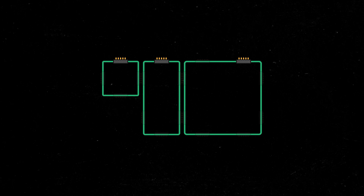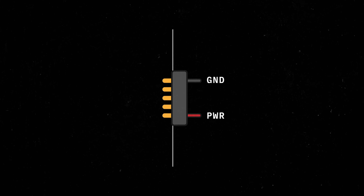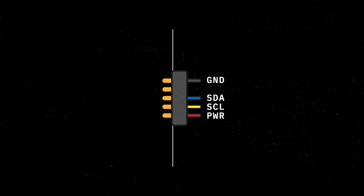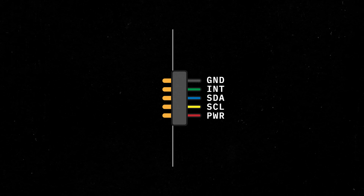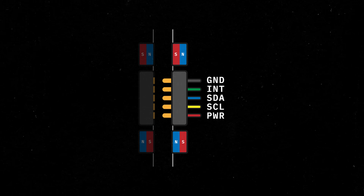I begin by making a size grid relative to the macropad dimensions where one grid unit equals a quarter of the macropad, assuming the macropad is a perfect square. Each external module could be a multiple of these units and should have one upstream connection and many possible landings on all the remaining sides. All connectors are centered within the grid units. For the connection itself we will need power, ground, two pins for I2C, and maybe an extra pin to use as an interrupt — for a total of five pins — and of course magnets arranged with the right polarity.